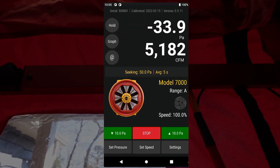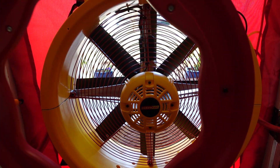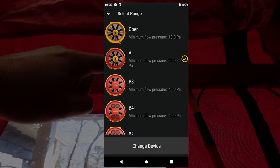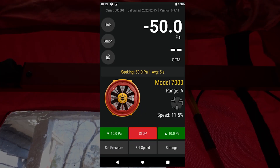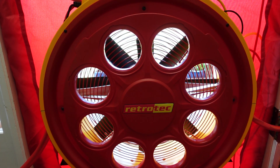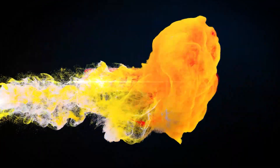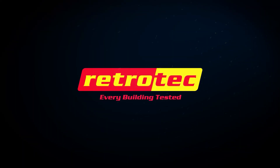When you're running your blower door test and you cannot reach 50 pascals, then you need to open up the fan more. For example, here we're on ring A, so we're going to remove it to have the fan completely open. Be sure to match the same setting on the gauge. If you can reach 50 pascals but you're not getting a reading on channel B, then you need to close the fan up some more. For example, here we're on ring A — we'll go down to the next range, B8. Thank you for watching. Refer to your manual and reach out to our support team if you need additional help.